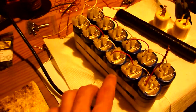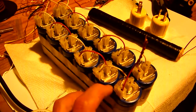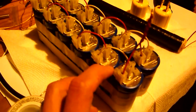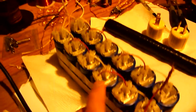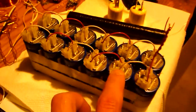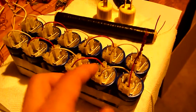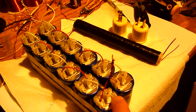And here we have a bunch of supercapacitors. They're 350F 2.7V Maxwell supercapacitors. They're pretty expensive — about $8 a piece. I wired them up in series, six in series and then in parallel with the other six.